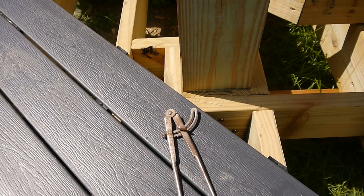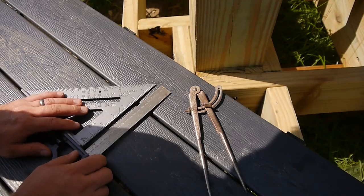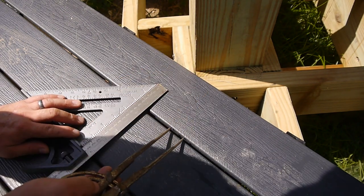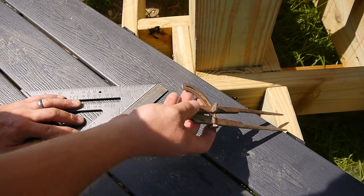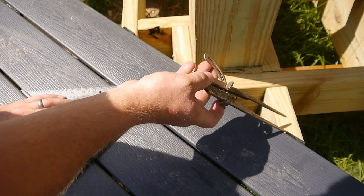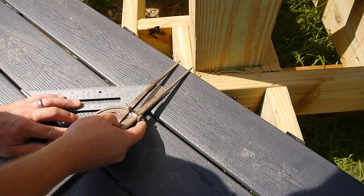Here's what we're going to need: some calipers, a machinist square, a regular square. We'll have to use a jigsaw to cut it out. So here's the plan — we've carefully measured the gap here: 2/16ths or 1/8th. And we know that this here is about 3/16ths to get it seated underneath, so we're going to need to be 5/16ths away from here.